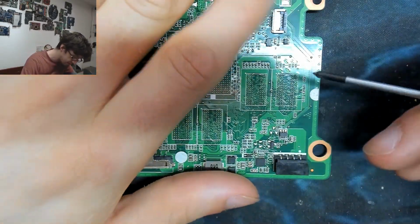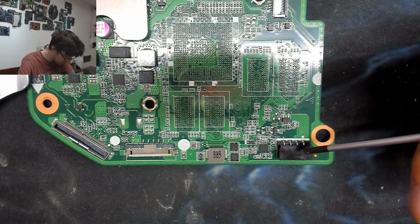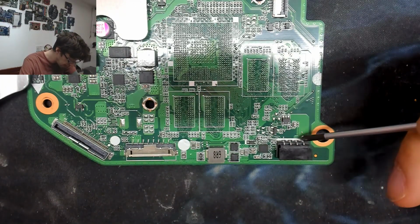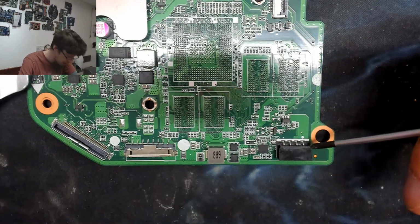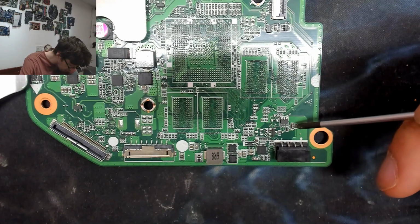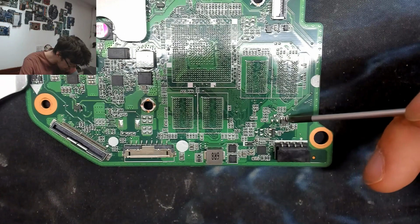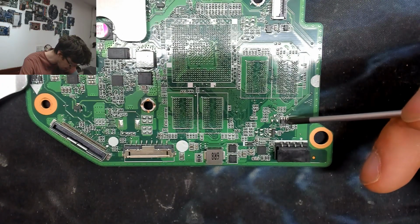Okay, so let's follow along. Positive pins were on the right. We have positive, positive, negative, negative. So the power comes in at this point, and you can see a big fat power trace there. Very obvious. That is going into some immediate capacitors, and then into this fella here, which might even be the inrush limiter.